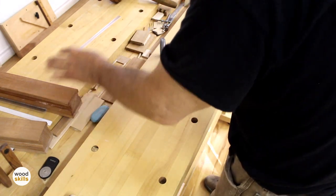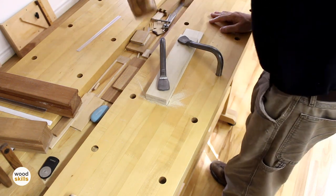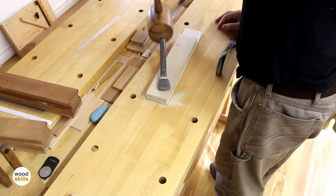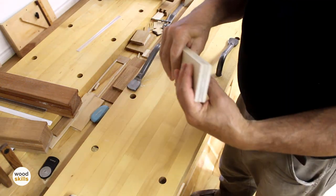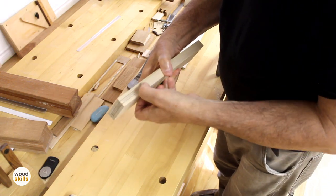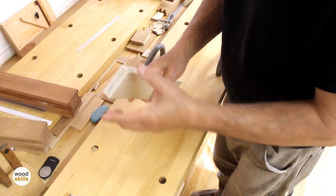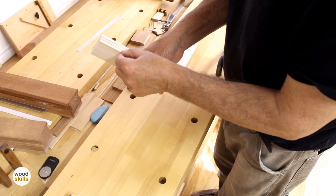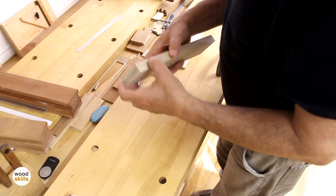That's done. I'll just release it. So you notice how straight the cut is on through on both edges and the end. So it's almost perfect. So considered machine made cut so far. So the goal is to extend that and keep that straight. And then we remove the material for this mortise component.